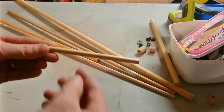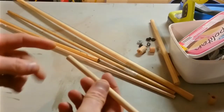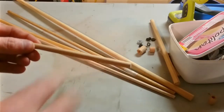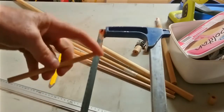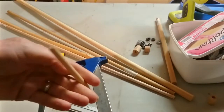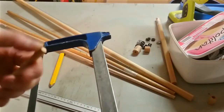The first thing we need to do is get some 8mm dowels — this is 8mm — and cut them at 125mm long. Make two of them. I recommend cutting these with a hacksaw because it's a bit more gentle on the wood since the wood's quite soft. If you use a hacksaw you won't break the edges so much.